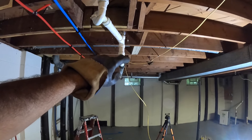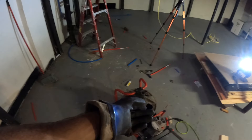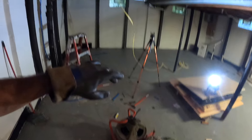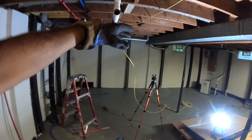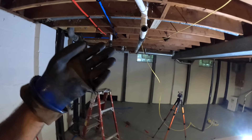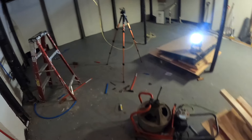I'll put this cap back on and then run a ton of water flushing out that line. This is just preventative maintenance, but you can always run the cable through a piece of inch-and-a-half PVC to keep it from whipping around and tangling up. Run it up to about here — it's a little tricky, but you can get the hang of it. I just didn't need it because this line really wasn't blocked. I was just doing a preventative maintenance clean. Always like to try to be as safe as possible.